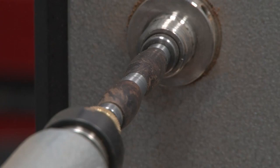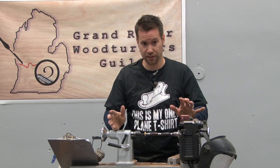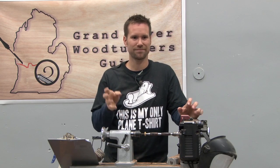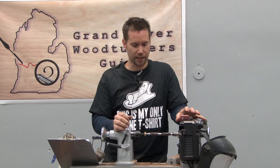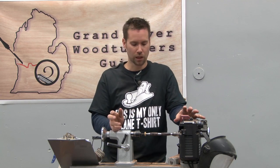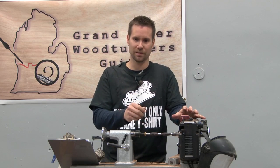Do you ever use a CA for finish? I have. I don't anymore, because I've heard that after 4 years that finish breaks down. Cracks off. The finish breaks down. So that's why I don't use it. When I did use it, I used a thin CA glue. I tried medium and thick. Thick was horrible because you applied it and it would gum up. You'd have high spots, low spots, it just wouldn't turn out.